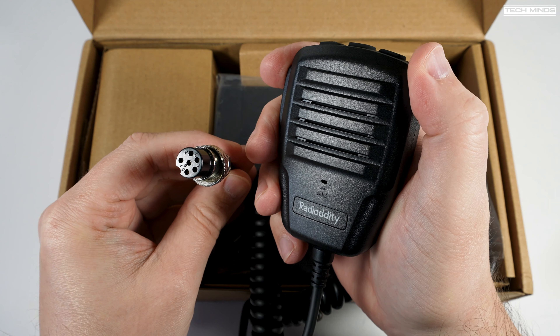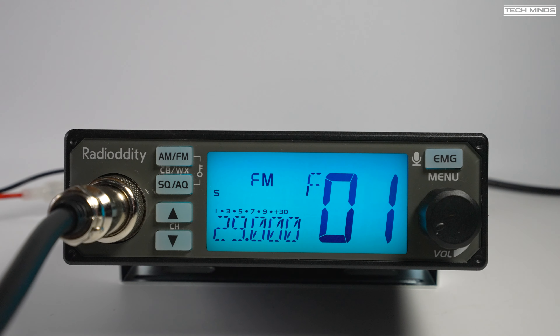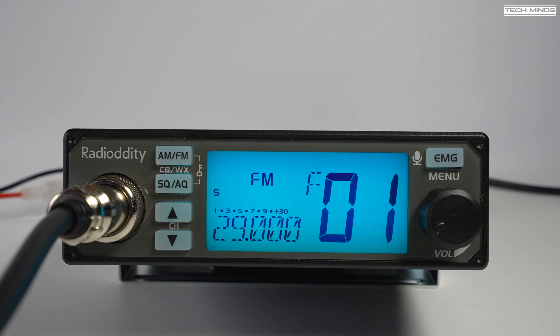To perform the modification, change the jumper position so it's across pins two and three. With just the jumper across two and three, the radio opens up to cover all bands and frequencies and provides the ability to set output power up to 15 watts. However, when entering the 10 meter portion, the last digit will be fixed to a five and it'll be in 10 kHz steps. So I also cut the white wire — the last frequency digit then changed to zero, allowing 5 kHz steps, with only the entire 10 meter band accessible and no CB bands. Perfect for my personal use.